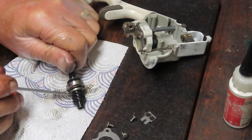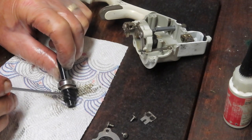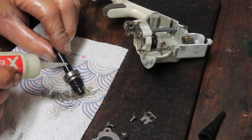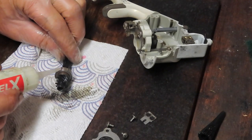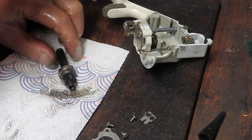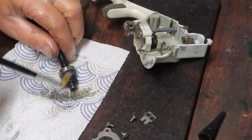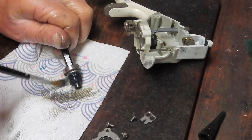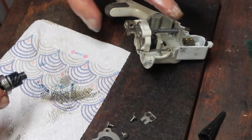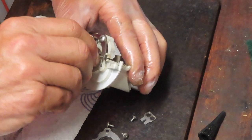The bearing metal is black — I'm not sure what it is, possibly anodized aluminum. I'm checking the grooves on the pinion; always do this to make sure there's no dirt in there. Then put some oil onto the bearing itself. For the main shaft, I'm using Penn Precision Reel Grease — I don't mind what grease you use; Corrosion-X makes a nice one too. Most manufacturers supply a grease but aren't in the lubrication business, so someone else makes it for them. Get the grease onto the shaft.